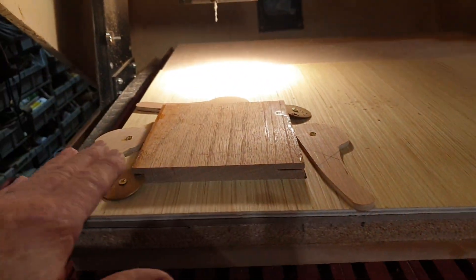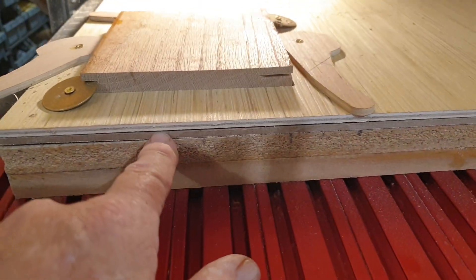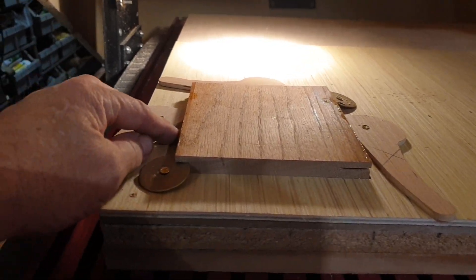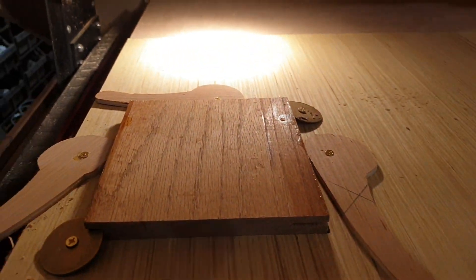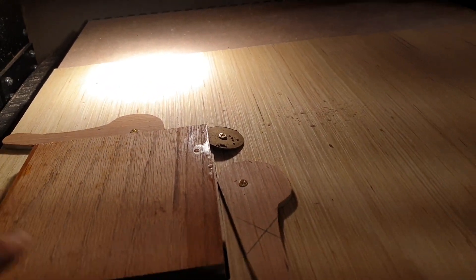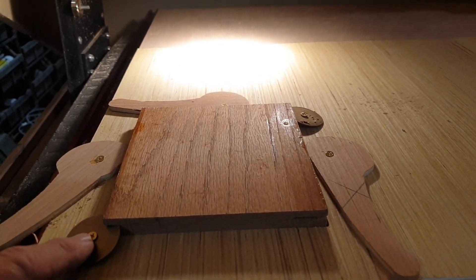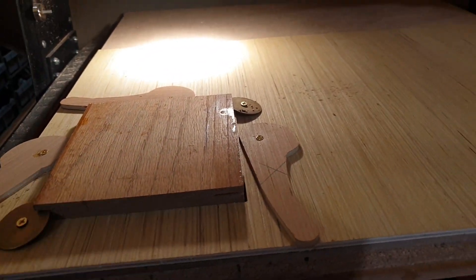After doing this a few years, the biggest enemy is anything that sticks above the edge of the board. My jig is quarter-inch plywood — I just draw a rectangle around my project and make it an eighth inch bigger, which lets me put a popsicle stick in there. Most of my blocks are square so I can cut them on a table saw — they're all exactly the same. It takes about 10 seconds to put the whole thing in and another 10 seconds to tighten the screws.